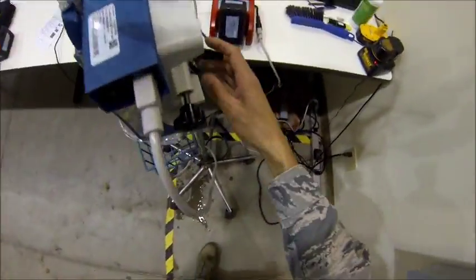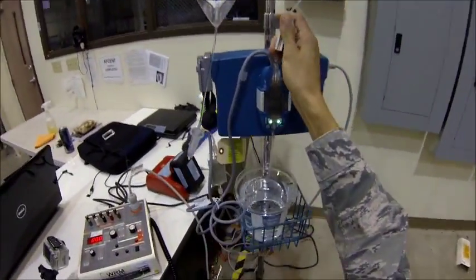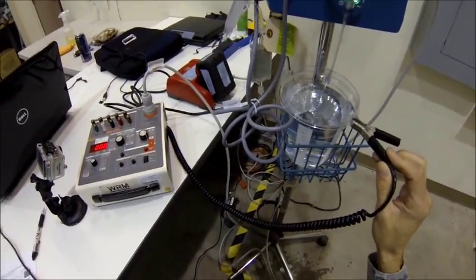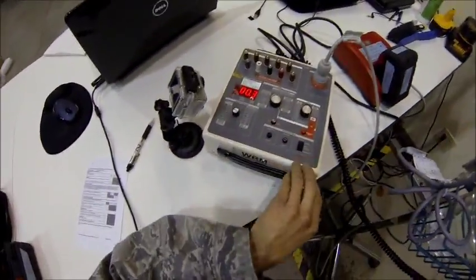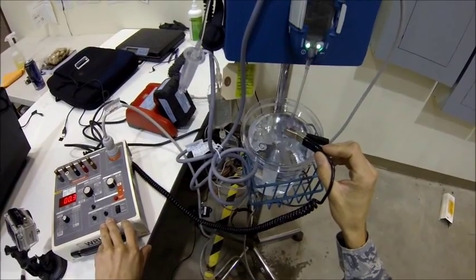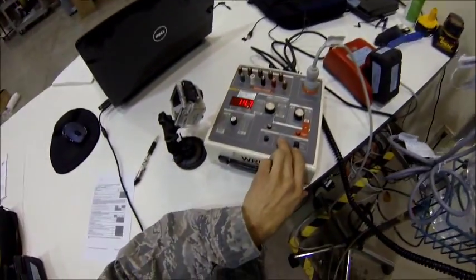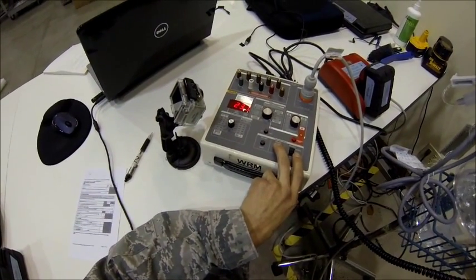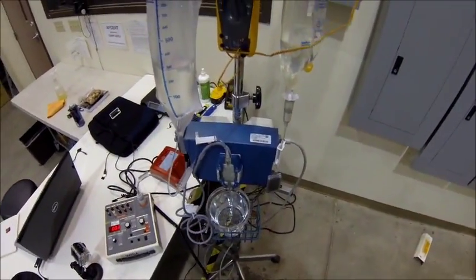Next, you're going to detach your Kelvin cable, and then start your stream again. It doesn't matter whether you use hot or cold water for this, all you need is water running through the heater itself. And you're going to switch back to external lead and put this in the stream. Now you're testing to see how much leakage is going through to the fluid stream, and raise your ground. And you can see we have 23.1 microamps, and that is good.